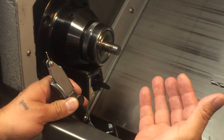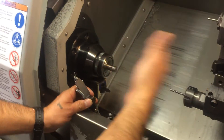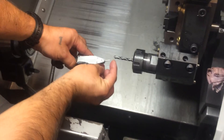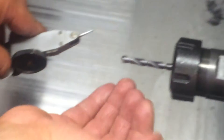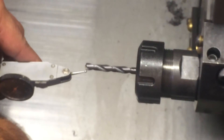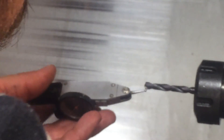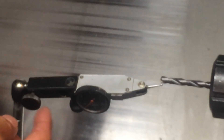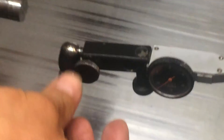On the SL20s, like the one we have at the college, you can start anywhere. But on this one I have to start right here. What you're going to do is place the tip of the indicator on the flute that is facing you. Get it close — you don't have to touch it yet. You just want to place it so it's going to make contact when you use your dial adjustment. I'm in position there. The needle is currently at the 15 mark, and now as I move this knob...